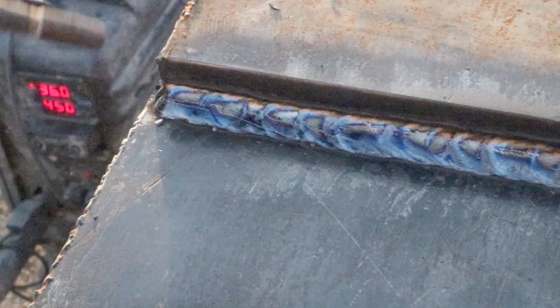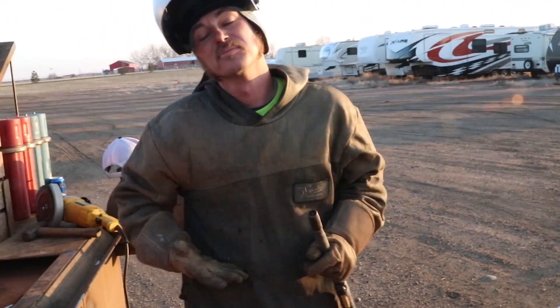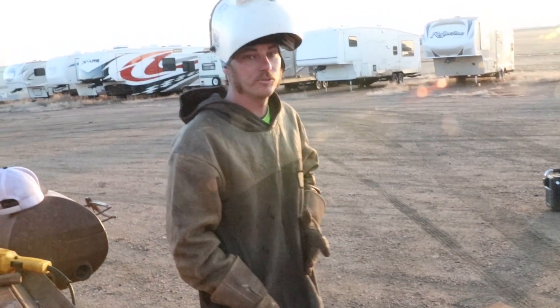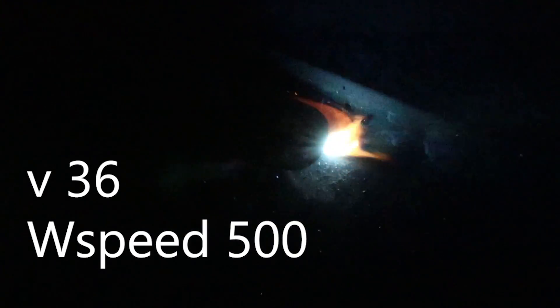This is why we got Kyle out here — because he knows what's up. Wire running. It's basically just so freaking hot, it's just spraying it on there. That's the way you run wire when you get comfortable enough. Bigger wire speed — be hot enough and run enough wire and you just let it spray and move. That's the name of the game. It's all about speed, but in the beginning you got to take it slow. Always told quality before quantity — speed comes later. Right now I'm going to go up another 50 on the wire to 500 and start building.